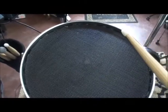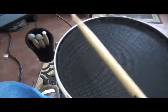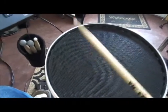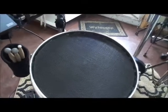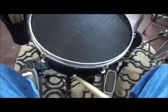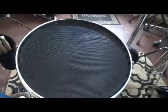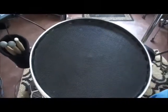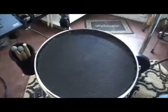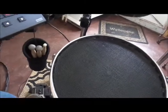First we're going to test the snare part. I'm going to go around the outer rim about an inch just to check. I didn't want cross fade — I didn't want to hear that bleed. A lot of times I put my piezo right down at the bottom so when I'm doing a rim shot or playing left-hand it triggers pretty evenly. You get a pretty good rim shot and a good rim click as well. When testing the rim, take your drumstick and go around it to make sure it's balanced.